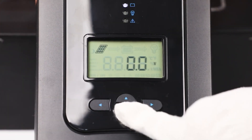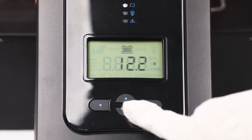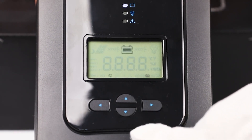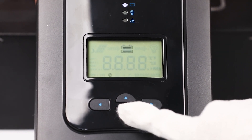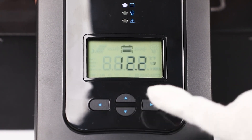The secondary step is to set the battery type. The controller can charge sealed, gel, flooded, and lithium batteries. To change the battery type, highlight the main menu screen and press and hold the right arrow button until the battery type screen shows up. The default setting is SEL, or sealed. After reaching the screen, press the down arrow button to cycle between the four battery options, then long press the right arrow button to save the battery type.